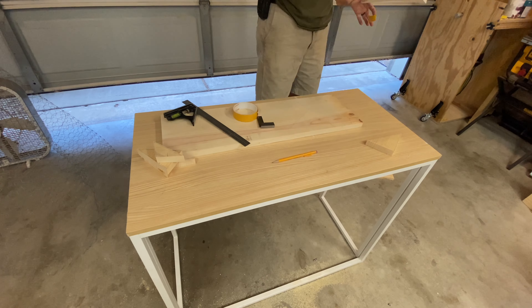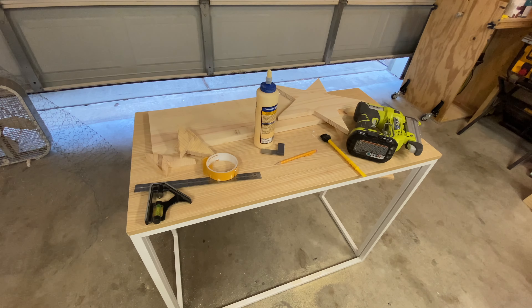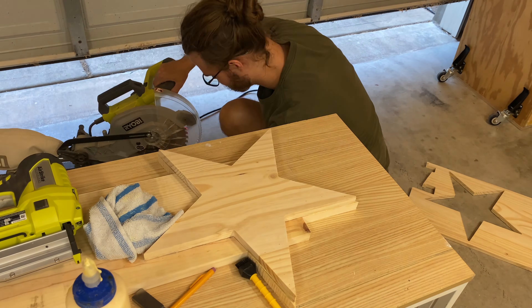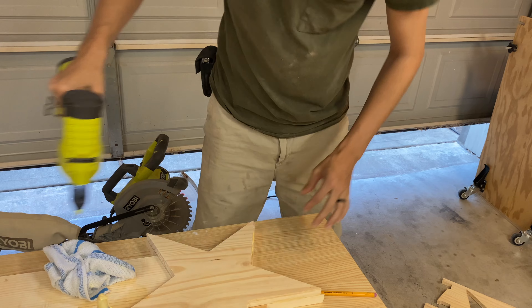Next it was time to line up the star and attach the pieces underneath. I then glued the pieces together using wood glue and held the pieces in place while they dried using 23-gauge pin nails. I ended up having to re-cut this corner piece — it comes to a 45-degree angle underneath, so I made it a little difficult, but I finally got it.